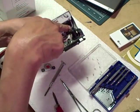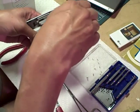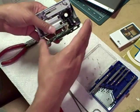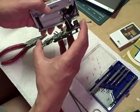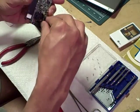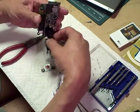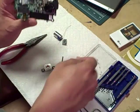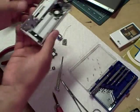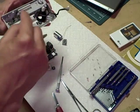Before you pull this thing completely off, you have to take this screw off. That allows the connector that's holding the USB — the cable connected to the USB connector — to come free. Once you get that off, you can just take these connectors off. The USB connector and the microphone cable just pull off — they're just little modular connectors, they pull right off. And there's the board. The USB connector is in there with a couple of screws, and you can take that unit off.